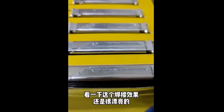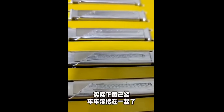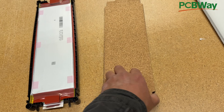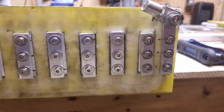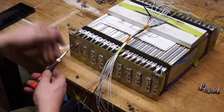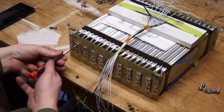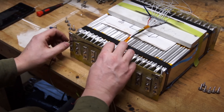So this is the reason why it might be challenging to use pouch cells in your DIY projects. But there is an alternative: mechanically bonding the tabs together with fasteners. The DIY world is full of examples of people that have successfully built battery packs using screws, rivets, or some other kind of fastener to connect the cell tabs together.